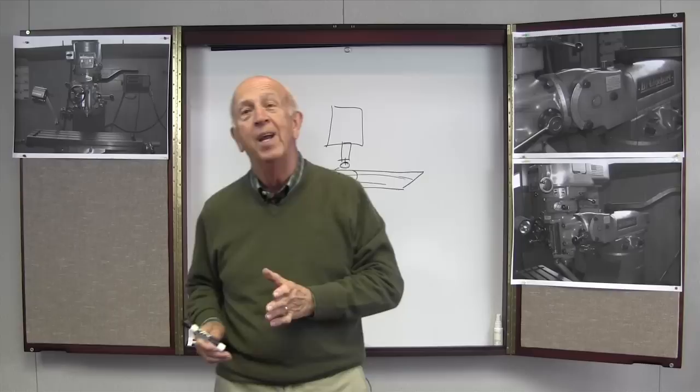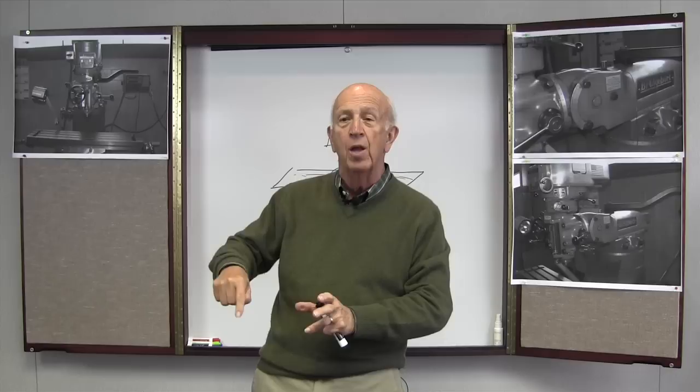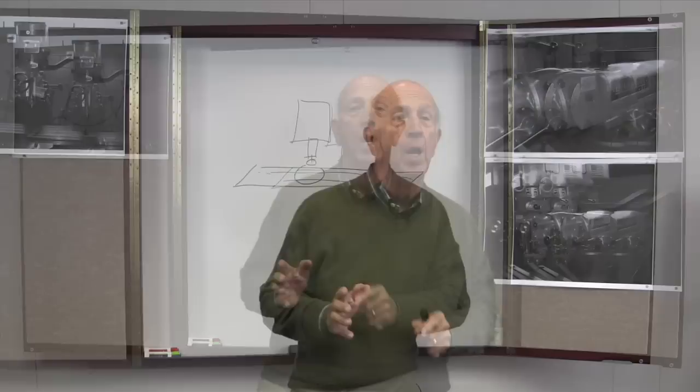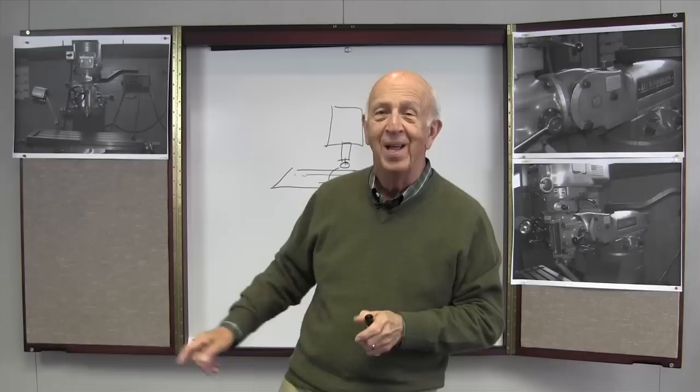We're making assumptions that the table is okay, that the knee is okay, and that the knee is not worn severely in the up area versus the lower area. Is it going to be perfect on an old machine? Probably not, but it'll be better than what you have. So it's a good idea to tram it in for close work. You'll really notice whether it's trammed in when you put a fly cutter on there and make a cut — if you see a cross or crosshatch pattern where the cutter goes over itself, that's how you know it's dead perfect. But you can also check that with an indicator. Please do the right to left first, get that out of the way, lock it down, then do the front to back. Don't try to do both at the same time — I've been there many years ago.